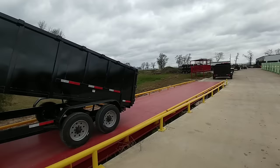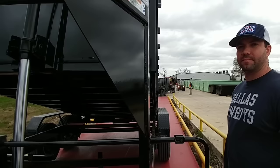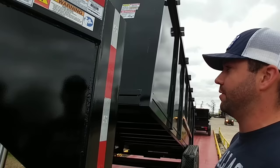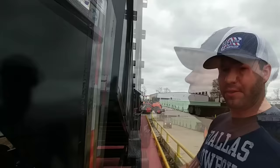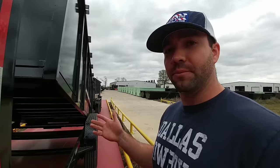We know that this one right now, empty before it rolls on, is roughly 5,300 pounds when it's not windy. Brad Walker, the engineer at Texas Pride, predicts the front telescopic cylinder is going to be the winner. With one cylinder you have two points of force, which simplifies the system with less energy loss. The big thing with the front mount is you have a mechanical advantage over the load — the cylinder is outside the load, so there's no moment on the cylinder itself.